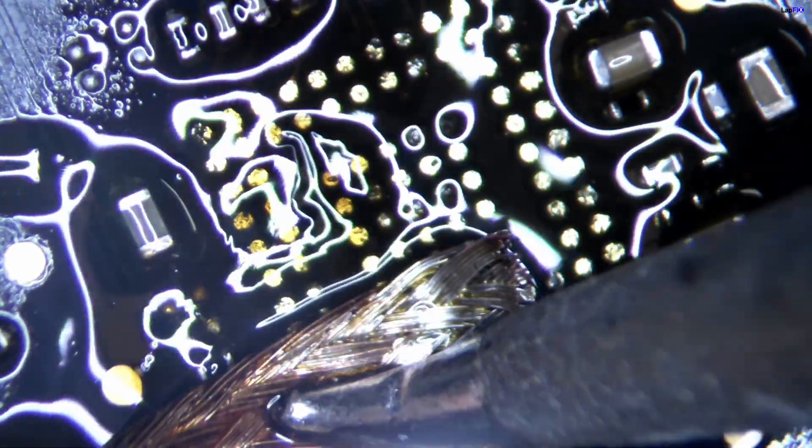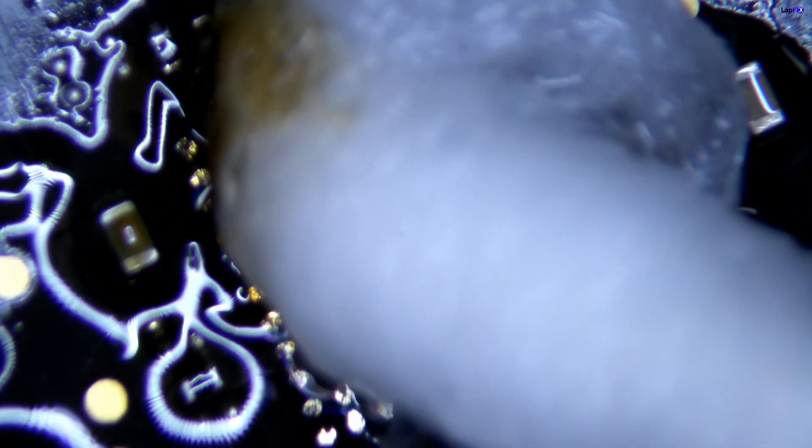This is what it looks like with the chip removed — you can see all the old solder balls left from the previous chip. What we need to do is clean the surface so we have a nice flat surface for a perfect connection between the board and the new chip. We're going to put some flux here and use a little bit of copper wick with our hot iron. The solder balls are going to be uplifted and it's going to clean the surface — we need to make sure there's no old solder to interfere with the new solder or cause any connection problems.